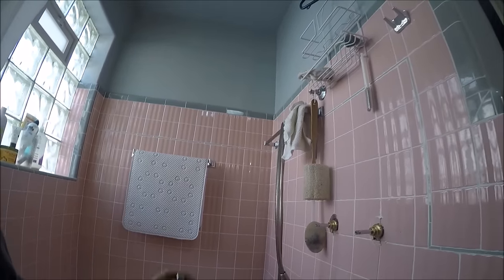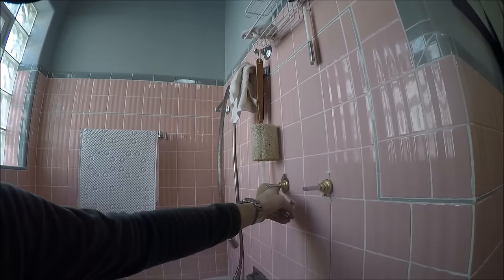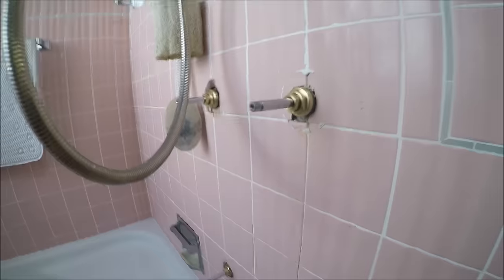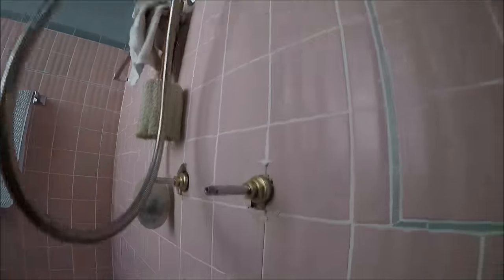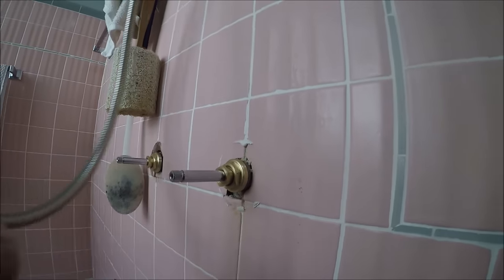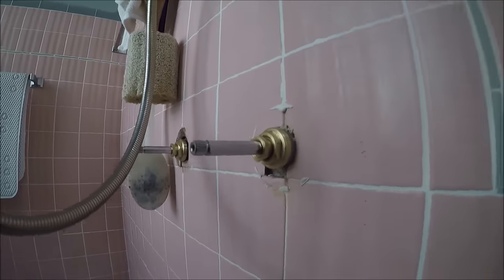Just to test my theory — there's nothing wrong with these. So that's all the rust bits that I pulled off the screen filter. This is what it's supposed to look like — you can compare that to the last video. We've got all the packing nuts adjusted properly to hold back the pressure that goes up to the shower head. I was surprised at how much I had to snug down on these outer packing jam nuts. I actually took the whole thing apart, took the packing nut out, inspected the packing, and put it all back together just to make sure, because I felt like I was tightening it down just a little bit more than was needed.